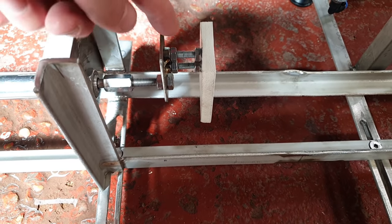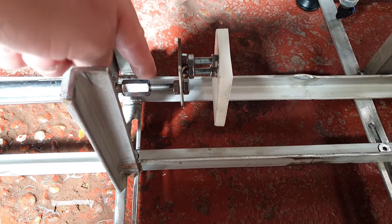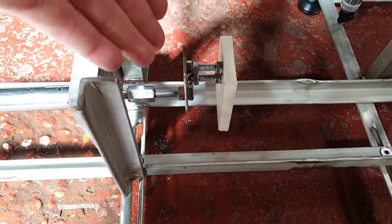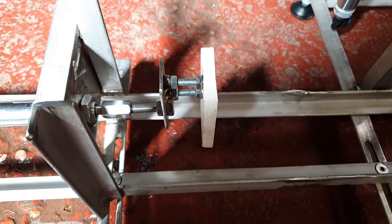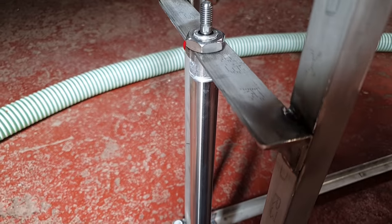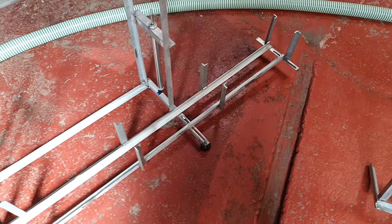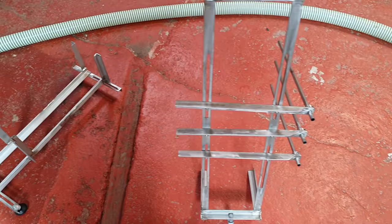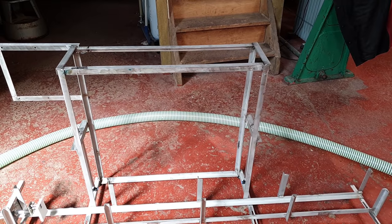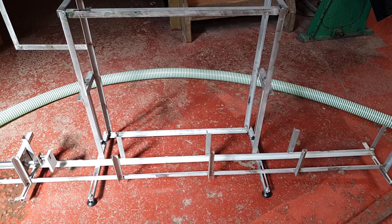In order to get a different setting for how far forwards the cans will be pushed, we've got this little contraption here which is adjustable on a tilt axis backwards and forwards with these two bolts. By varying the size of this bolt we can set the start point of where the can push mechanism comes from. We've got the bolts in the top of the pneumatic cylinders as they were, just for prototyping, so all we need to do is pop that carriage back into the chassis.